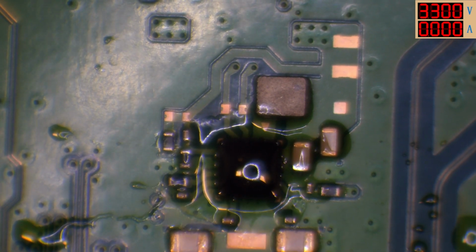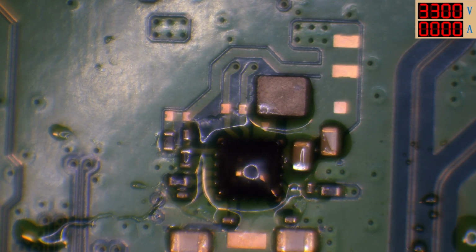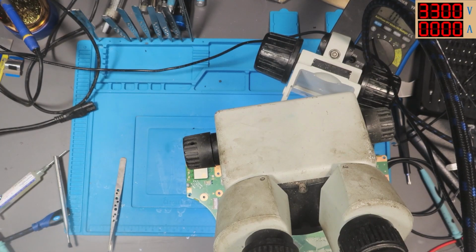Right, that should do it. I think I've put the chip in the right orientation. Oh yeah, I agree, Chris. If it was anywhere on the 3.3 volt there, you are right, it would still be present without the IC there. But if it's still got an issue with this IC on it, then it's very unlikely going to be this.